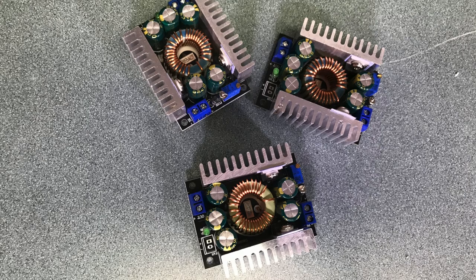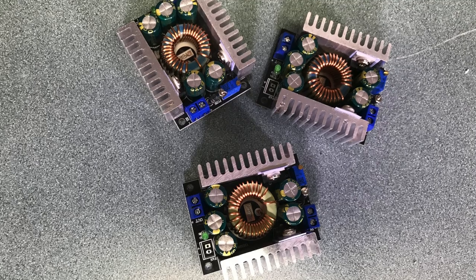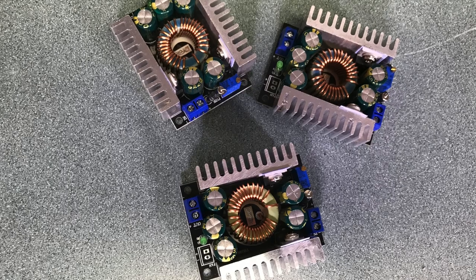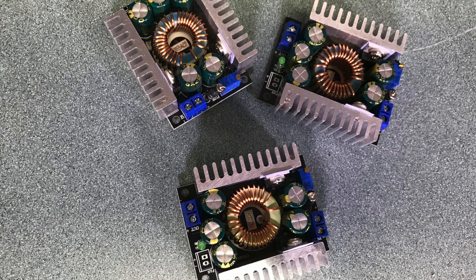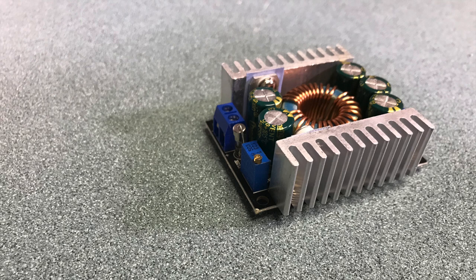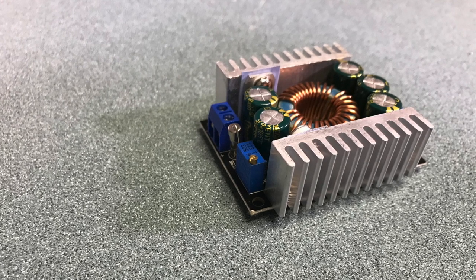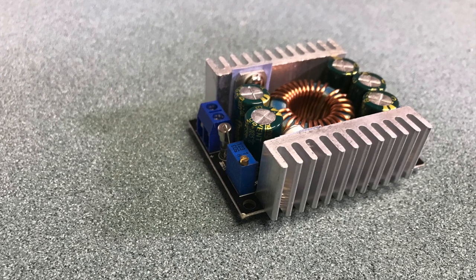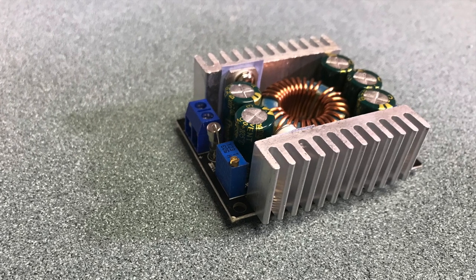What I do love is a DC-to-DC converter, which allows you to put in your battery voltage and get out whatever voltage you'd like. The beautiful thing about these converters is that the output voltage stays constant even as the battery voltage drops as it's depleted. That way you get a nice constant 5 volts — or 9 volts, 12 volts, whatever you set it to. They're easily adjustable and they work great. There's a link in the description to buy one, and they come in different current ratings so you can supply as much as you need.